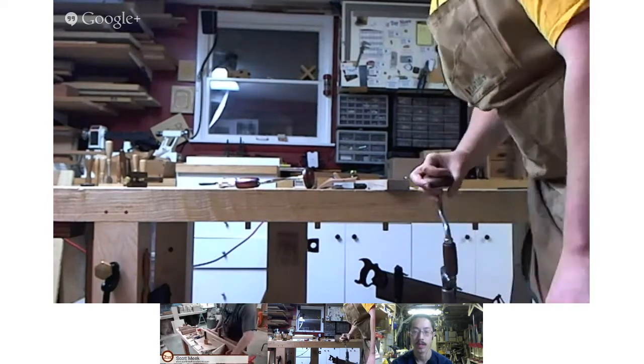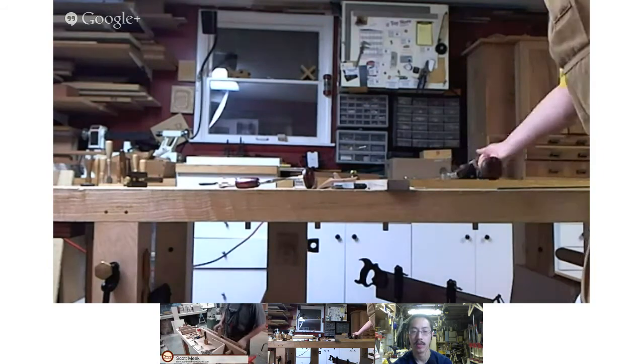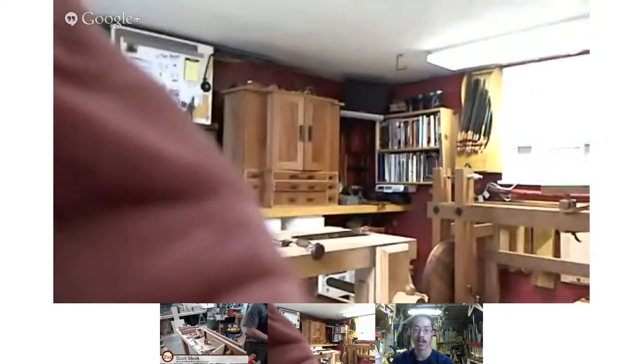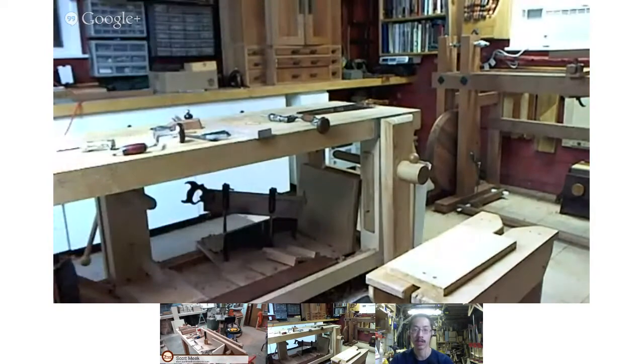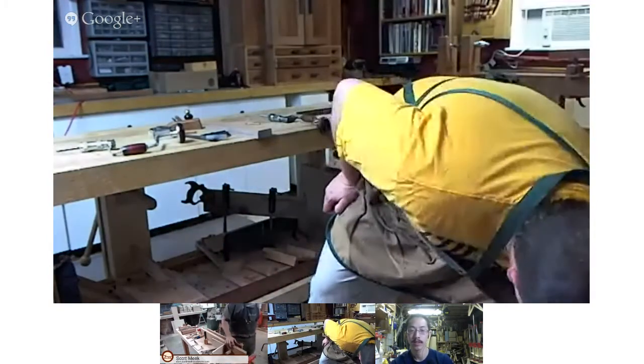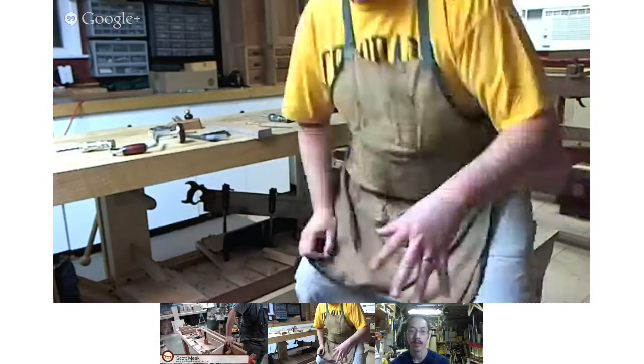Just by sliding your head back and forth like that. You can see how fast they bore. They're really very quick. And you talked about being able to make an adjustment on the fly. Is that simply by continuing to rotate the brace and tilting it to one direction? Yep, exactly. Because it just slides around on that spoon, that bullnose tip, it allows you to make that rotation.